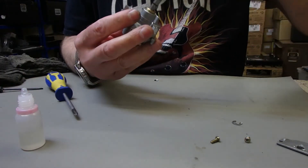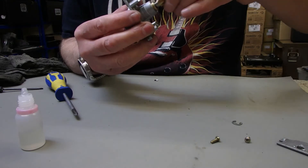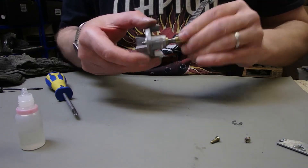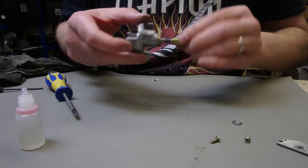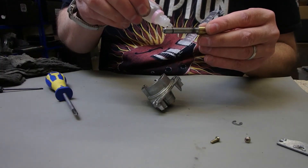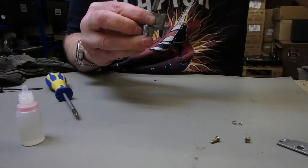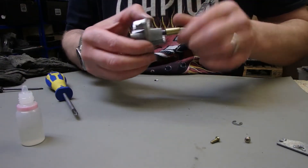I like to put a bit of oil in the groove where the circlip goes. Then I can put that in and it will carry the oil down into the bearing. Then we can give it a good move around — we can also do that the other way. Just a little bit more, so it's in the groove, which will allow it to carry into the bearing.